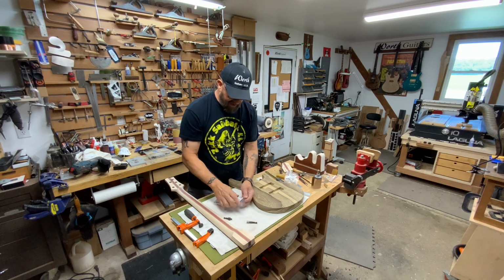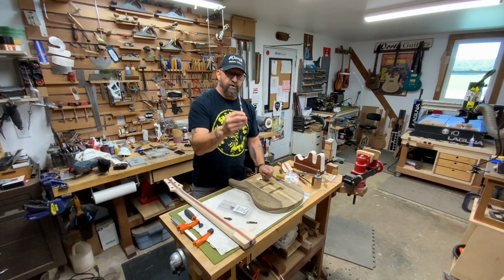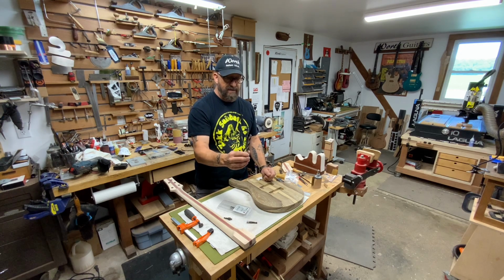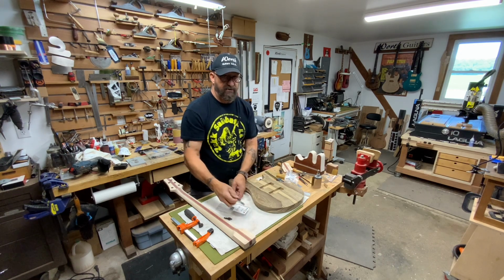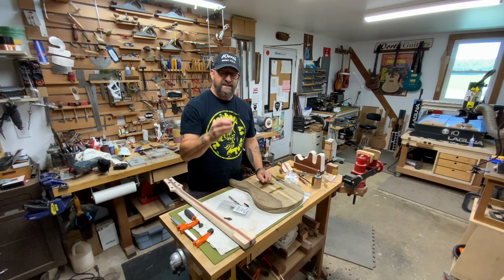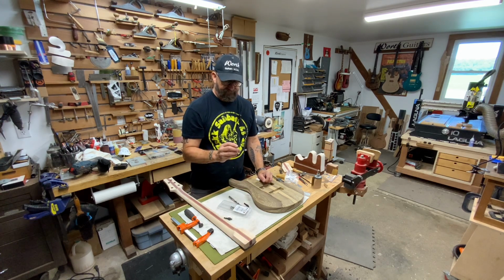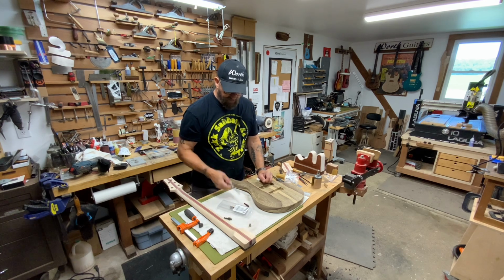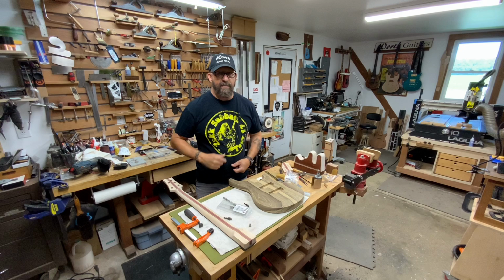Because you get the right size drill bit that they suggest you use for the threaded insert, that helps a lot. And you're not guessing at the exact right size you need to be using, to get these things down inside this maple without a big hassle. Right, so let's go over to the drill press, get this set up, get that drilled. I'll be right back. Let me go get set up.